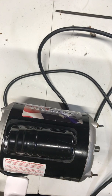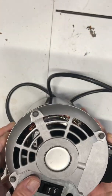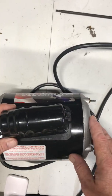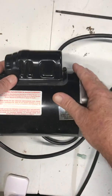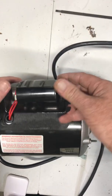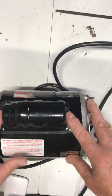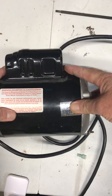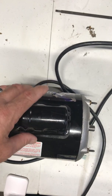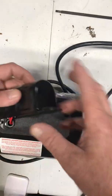This motor could have a relay or a centrifugal switch — you can see there's a lot of depth in there. How do you tell it apart from a split-phase motor? Simply by the capacitor. If I take this off and look inside, we can see the start capacitor in there. Anytime you see a motor with a dome or little shark fin on top, that is going to be a capacitor start induction run motor.